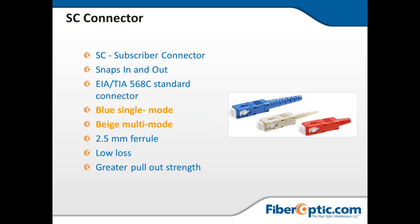So getting back into the SC connector, which is going to be, once again, our future, something that gives them away right away is the blue to beige, or I say gray, colors. The SC subscriber connector snaps in and out. The EIA/TIA 568 standard connector, it's just the governing breakdown, so they're all uniform. Still 2.5 millimeter ferrules. These are the bigger boys for the connectors. When we get to the smaller connectors, we'll go over the ins and the outs of them, and they're half the size ferrule-wise. Low loss, greater pull-out strength.